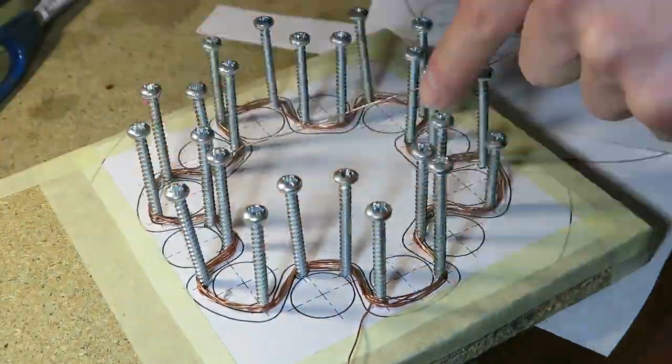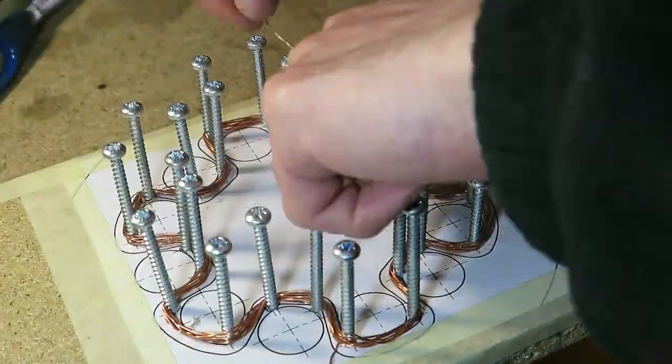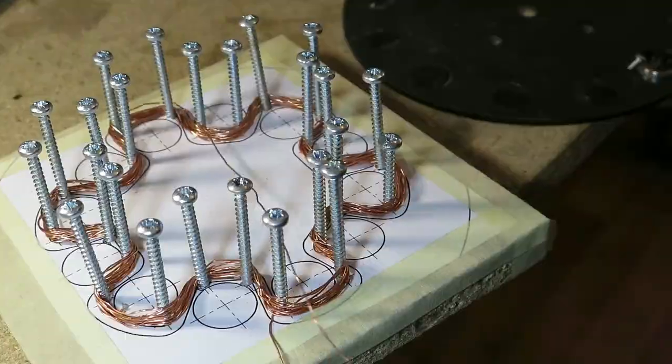This winding process is quite labor intensive, but instead of doing this you can make a ring-shaped coil and then press it into shape. This simplifies the process to such an extent that you can make say 10 coils for a 1 kW motor in 1 hour.